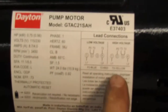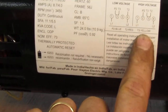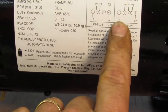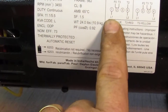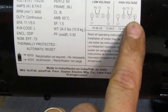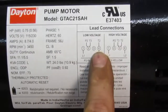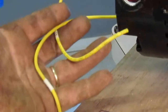When we look at this, we're going to see blue, red, yellow. For the high voltage, line one is at number one. For low voltage, line one is also at number one — so we don't have to move that one. Same thing with line two: it goes to number four for both. So we don't have to move anything with these two lines that come with the pump.